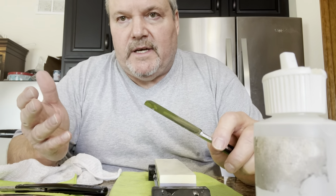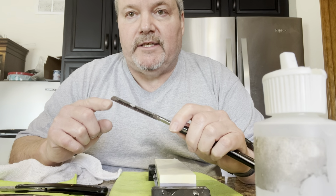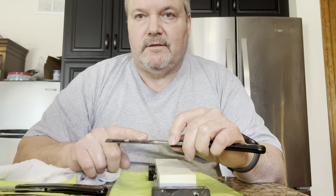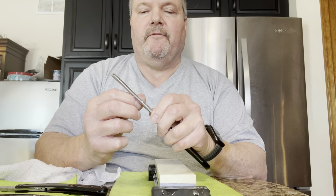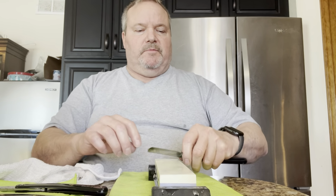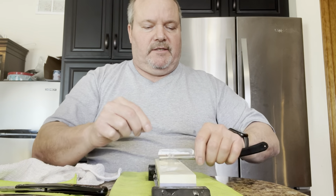Okay, so on my timer here on the video, including the amount of talking I did in the beginning, I'm at 18 minutes, and with the magic marker test, I pretty much have got where my stone is contacting to create a bevel. I am feeling with the thumb pad that it needs maybe a little bit more. There are parts of it that are a little sharper than others, but I'm really close. So it doesn't take that long. The 1000 grit stone works pretty fast.